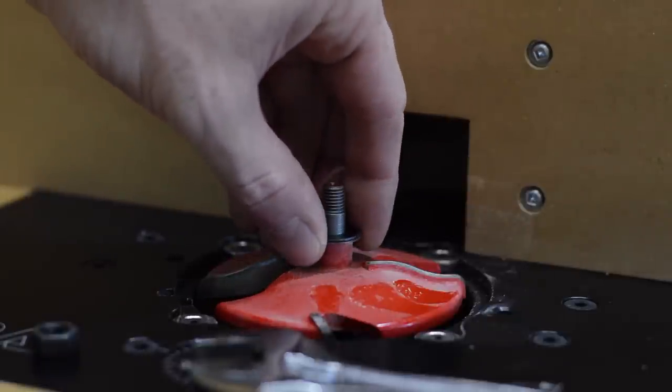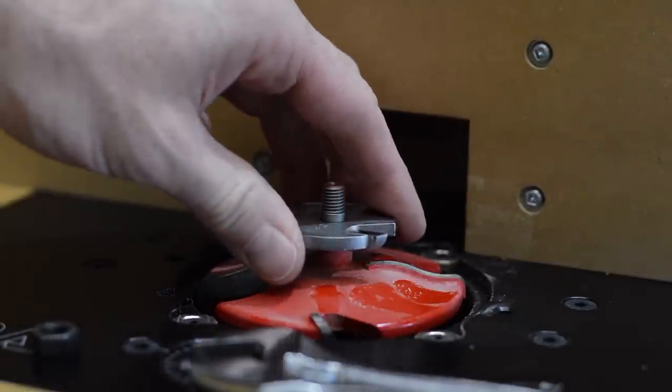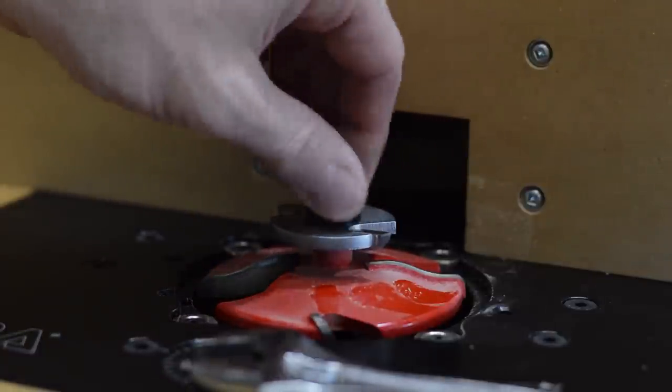Overall I think these router bit sets are very good. One thing I don't like is that they're not calibrated from the factory, so you have to sit there and adjust all the shims until the fit is just right between the three bits.